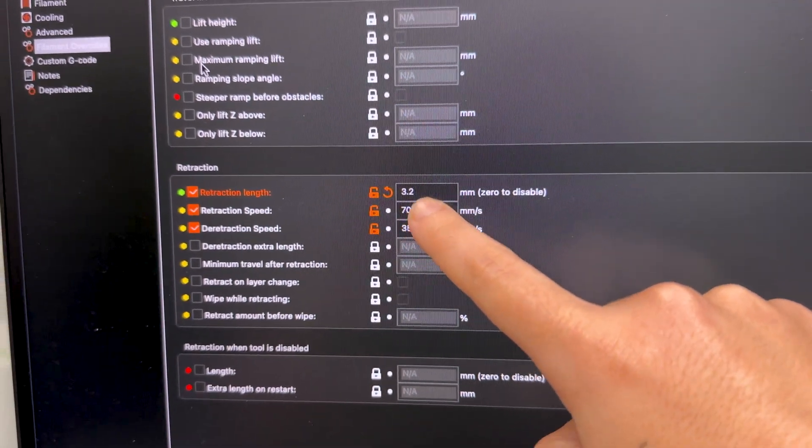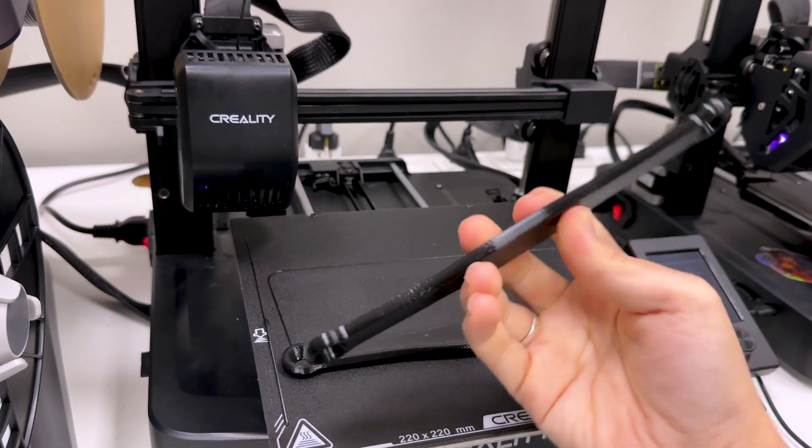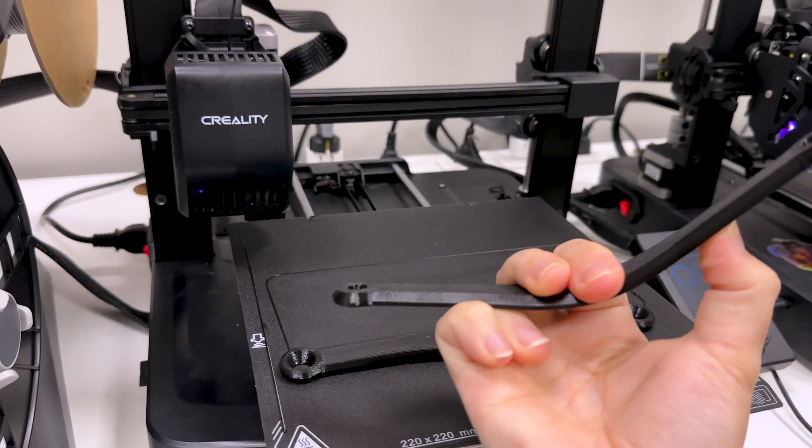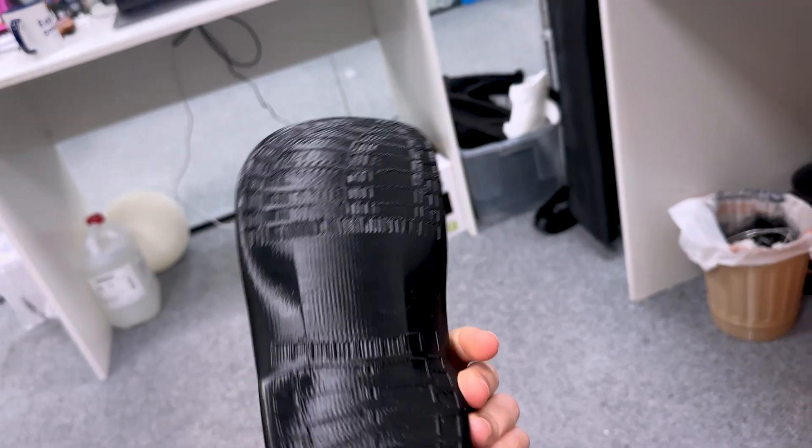With the correct settings, I adjusted the retraction to 3.2 mm, and it went perfectly! While I was printing a test for the Arca slider model, I also put a pair of crocs to print. I got super impressed — the print turned out great! However, we had a few small issues. I printed it with 3 walls and 12% infill, but it was too stiff. So for the other foot, I lowered it to 2 walls and 10% infill. It got a bit better, but still too hard. I think we can lower it even more to make it more comfortable. Luckily I sized up the scale a little bit, because it was a tight fit.